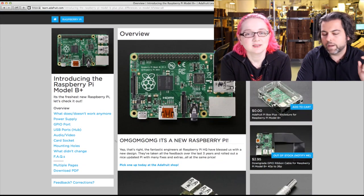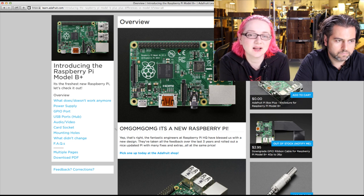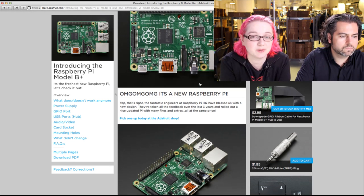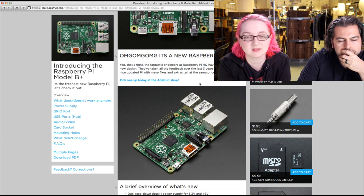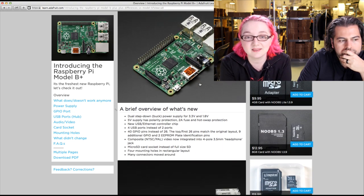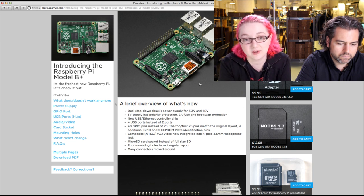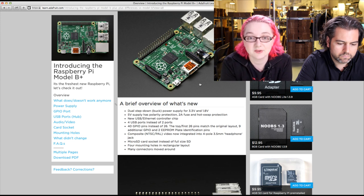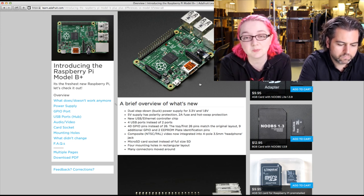What is new with the Raspberry Pi B Plus? We got one of these pies late last week. The Model B Plus is the evolution of the B — the Model B being the standard Raspberry Pi. They're not just continuing the B; they'll have both. The B Plus has more USB ports — there are now four, thanks to a new USB Ethernet chipset. There are 40 GPIO pins instead of 26, two special identification pins on the GPIO, and the composite port was merged into the audio port — there's now a four-pole audio-video port.